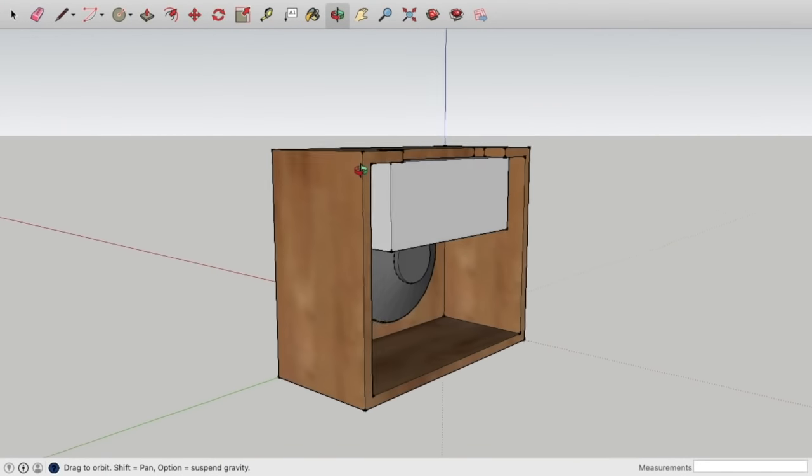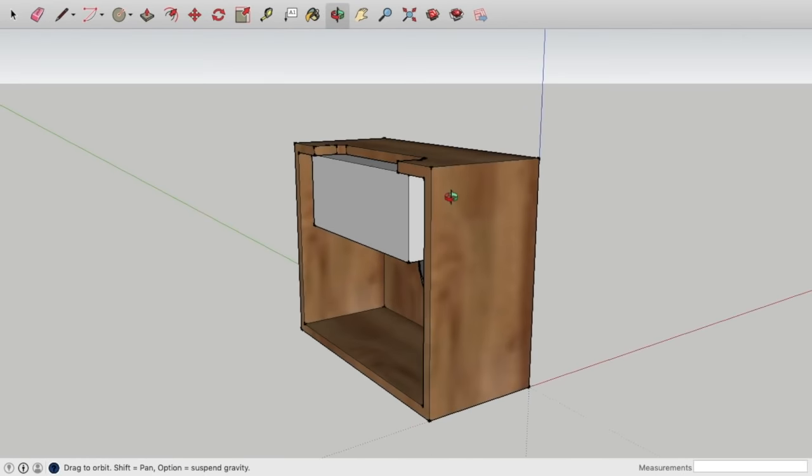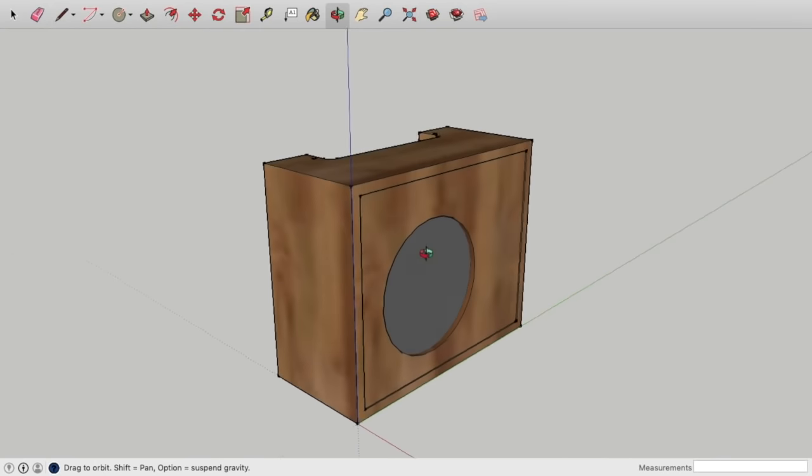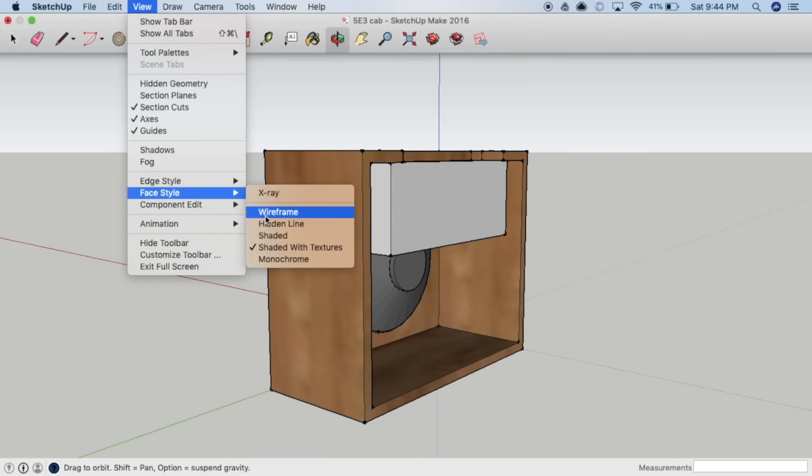So now that I knew that it sounded pretty good, there weren't really any issues with the amp itself. I did a voltage chart and measured the bias of the output tubes, and everything looked good.